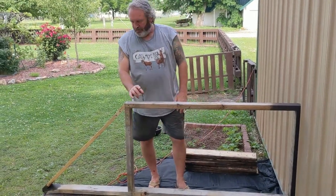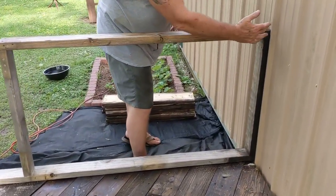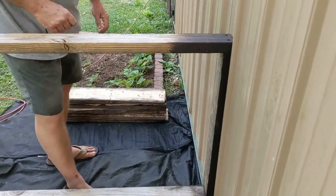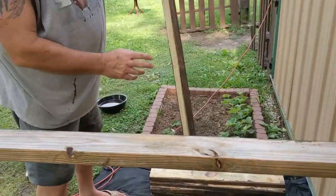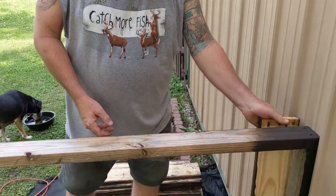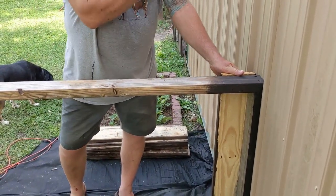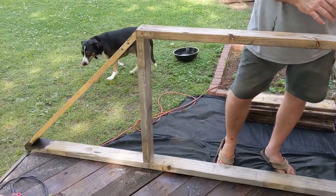What I've done is pre-stained some of the area as well - anywhere where it's going to be touching the side of the shed. I've stained up on the top here, the same with the slats that I'm going to put up, just stained along the edges first. So you can put these straight up now. Once it's all secure you don't have to worry about the finicky little staining in between everything, so a bit of pre-staining always helps.